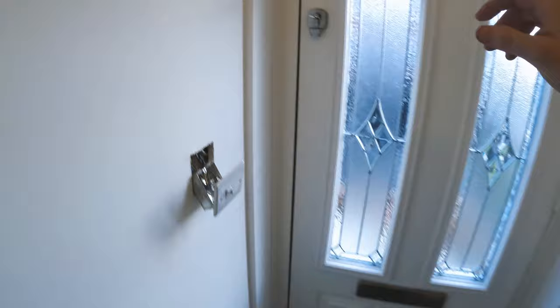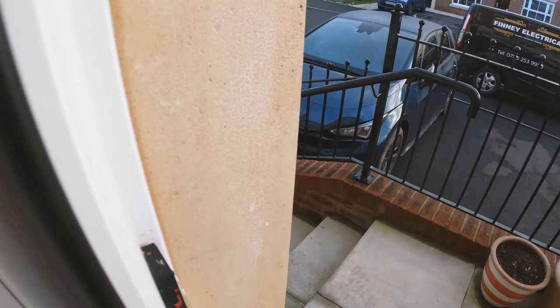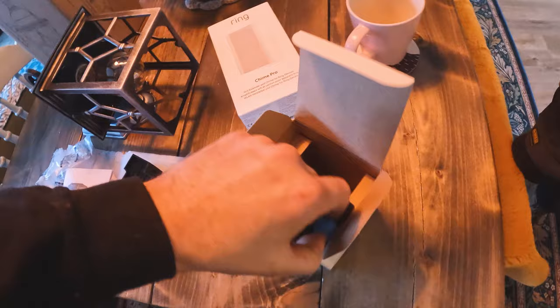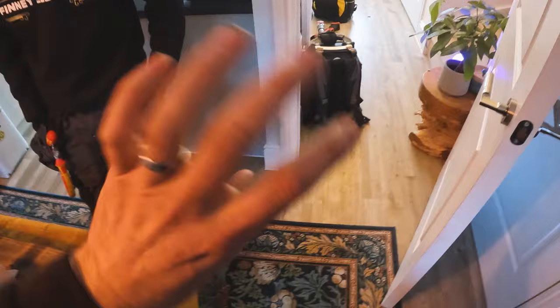You're not going to see much as far as the car. So if we just plonked it there, it'd stick out way past here anyway. And because it's got such a wide angle, you won't see anything. This camera angle, you'd literally just see that - you won't actually see that car and what's going on. So that's why we're going to drill through the pillar. And you get a little cool screwdriver with it - a little security screwdriver - to put the little grub screw up underneath once it's all done. And you've got a little angled bracket so if it's not quite facing where you want it, you can angle it that way or that way depending which way you put it. That's what comes in the box.